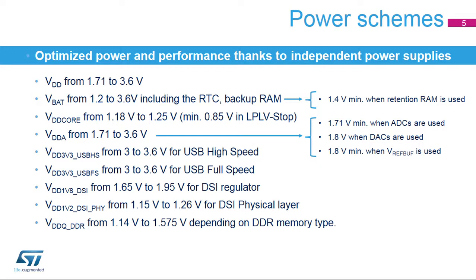Here is a summary of the PWR control-related interrupts. The debug control register is used to enable debugging in stop and standby modes. When the related bit is set, the CPU clock and bus matrix clock are kept active, and the regulator is kept on in normal mode to supply the core logic. This maintains the connection with the debugger during low power modes and keeps debugging alive during and after wake-up. Remember to clear these bits when the device is not under debug, because consumption is higher than all low power modes when these bits are set, as they force the regulator to remain enabled and keep clocks active.